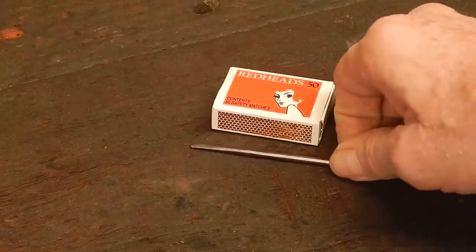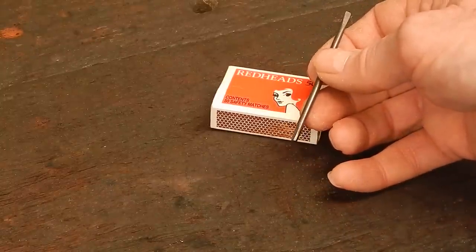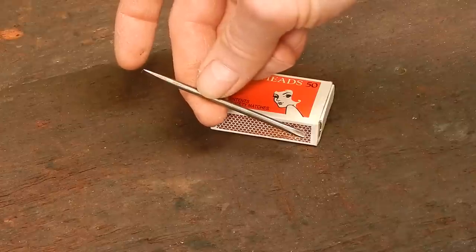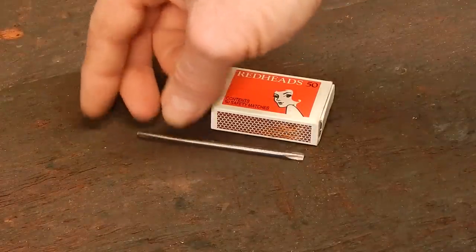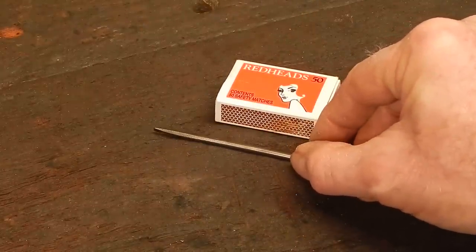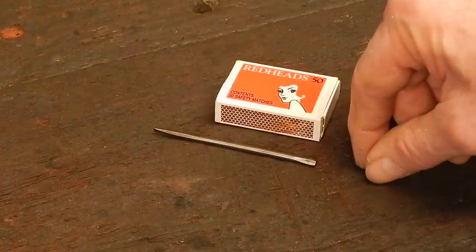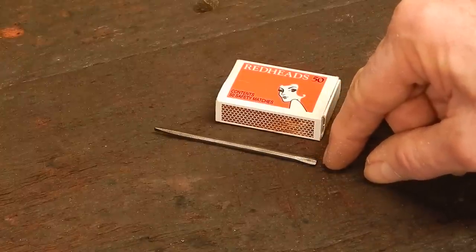It's not very big. I thought, you could probably make up another wooden end and stick it on. And then I thought, it'd be nice if it had an aluminium end on it, and maybe even knurl it. I'm going to have a crack at it. See if I can cast an aluminium end onto this, and then a cylinder of aluminium. Make it longer than you need so you can grip it, and I might be able to knurl it. Although my nail may not get into it that closely, we'll see.